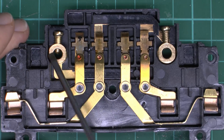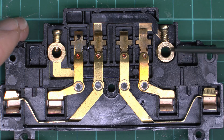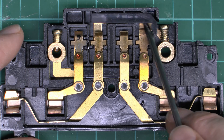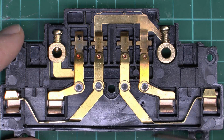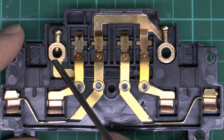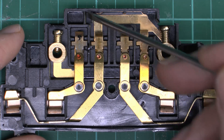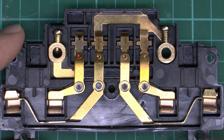Inside there we've got the two terminals — this is the line on this side, and the neutral over here, with a single screw to secure those. And then the actual conductor comes across the top into this switch here, and this piece should remove, and then it continues across for the switch over this side. So it basically goes to the terminal here, and again the terminal on this side, and the other one comes underneath and again goes into the switch, then obviously goes to the terminals via the switch.